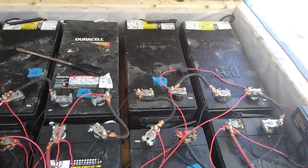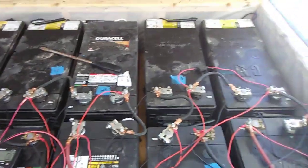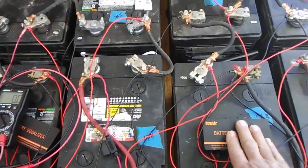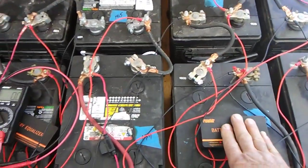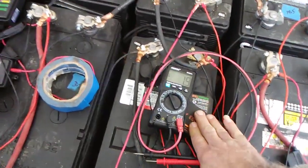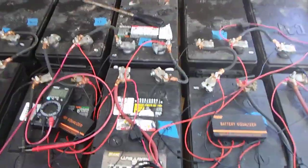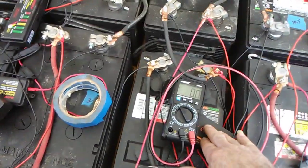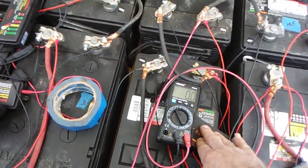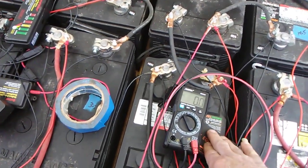I figured something wasn't right — there's probably a battery in here that's going bad. The way I figured it out was I came out here and just put my hand on these battery equalizers and tested to see what the temperature was, how they felt. As I went around, I found some that were much hotter than the others, and that told me the hotter one was doing more work than the other ones.